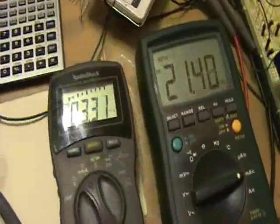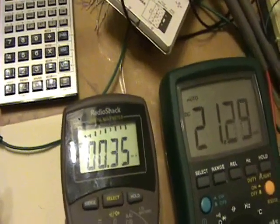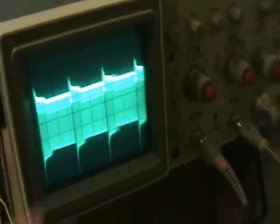The first thing I wanted to show is if I dial this resistance basically to infinity — or actually, I'll just unclip the coil completely so that the secondary is not connected. With no current flow, the supply voltage is really low because I'm pulsing at a very slow frequency. We see that phenomenon where there's ringing between the pulses, like I talked about in my previous videos. So this is almost like an antenna at this point, receiving energy.